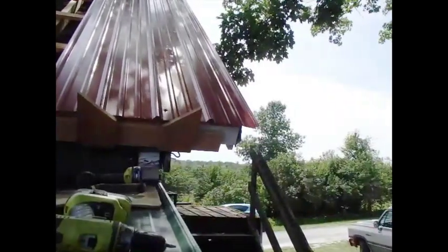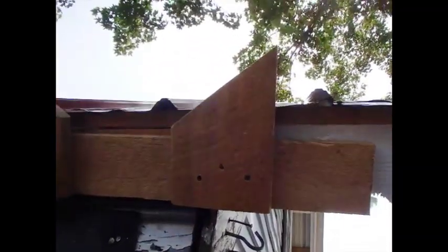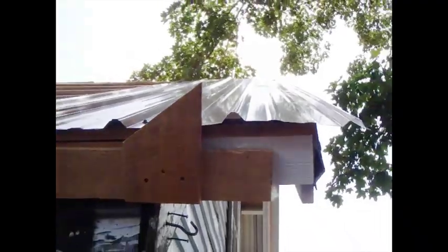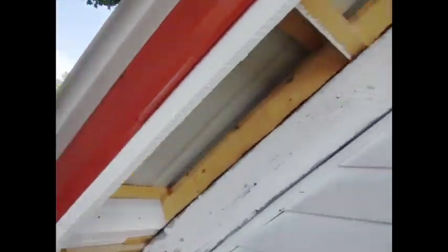I'll come down here again and look at my angle. See that inside the lip — I don't know if you can see it over here, but that inside piece of tin, that corner piece, slips up inside of this one. There's a little ridge there that it sits on, and that lines the whole thing up. If I can do this without falling down — I can see that the outside tin is right on the edge of that groove there.